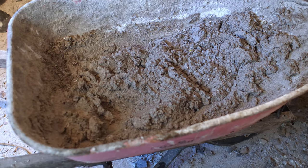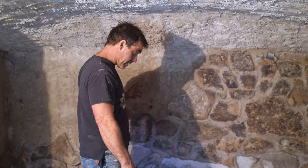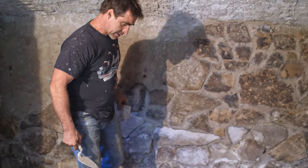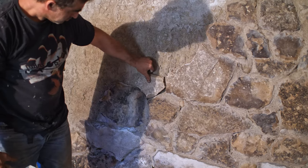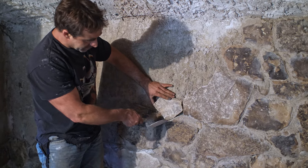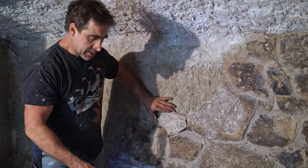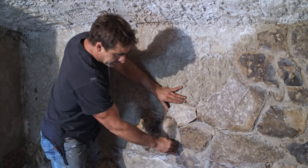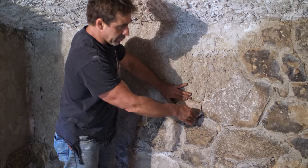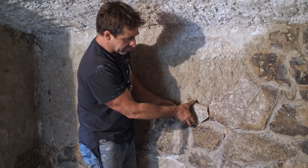Okay, I get a consistency something like that. So I've got my wall here. Typically what I'll do is dry-fit some stones prior to mixing up my batch; I did not do that today. I think we've got a winner here. I had a little V-groove in there — something that seats into there. I'm trying to do fairly tight joints, but at the same time I'm always trying to create a horizontal line as much as possible. You're also always looking to tee up a vertical line — you want to cap that. You don't want vertical lines extending from stone to stone up the wall; that makes for a weak joint that's going to split away later. That is a pretty reasonable fit for what we're doing.